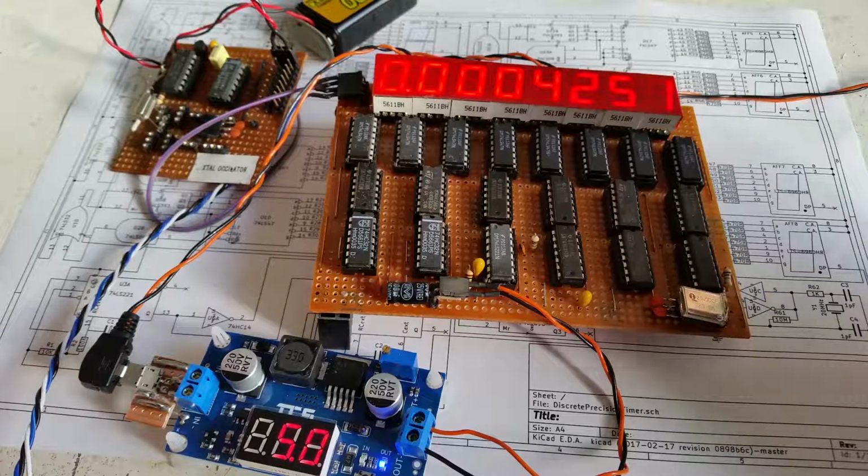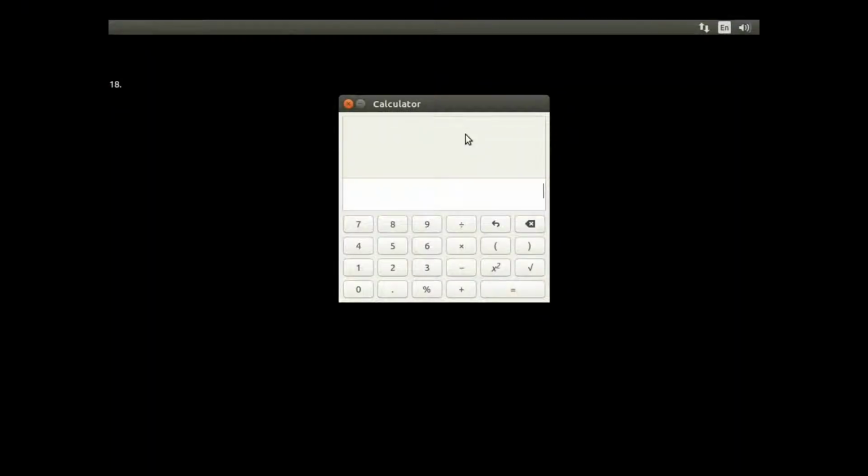So the 8 megahertz should provide a certain figure. For an 8 megahertz clock cycle, the value I'd expect to see on the timer would be 1 over 8,000,000, so that's the inverse of 8 megahertz. This is what I expect to see, but I've only got 8 7-segment displays, so I only expect to see 1, 2, 3, 4, 5, 6, 7, 8. I only expect to see the last value on the 7-segment display to be a 1, but because there's an extra 0.25 above that, it could be a 2 or a 1 because of potential error.